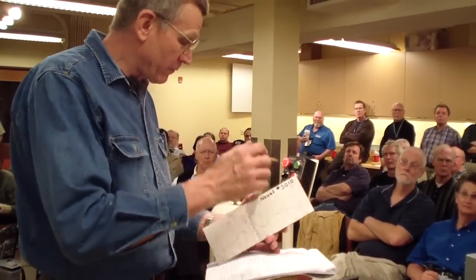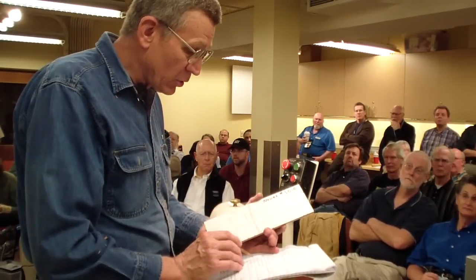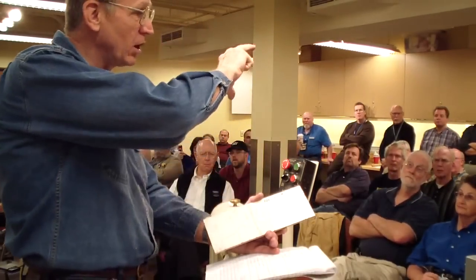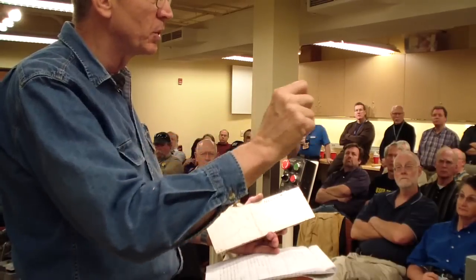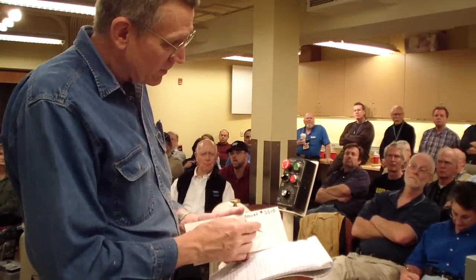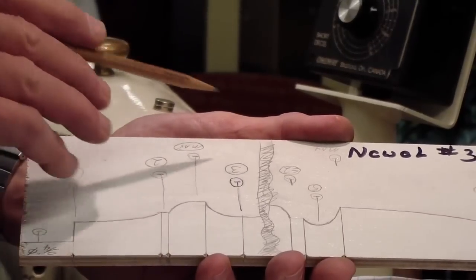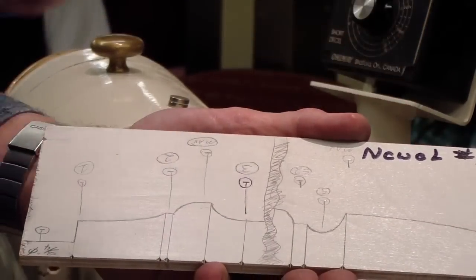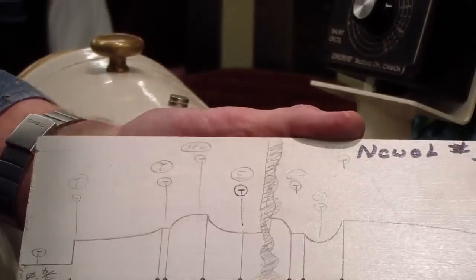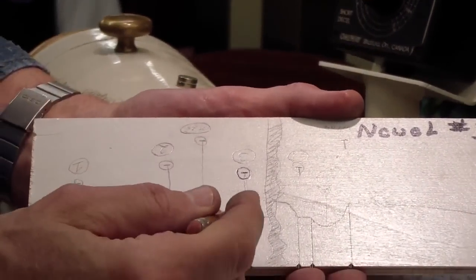And you lay out from your pommels, and then you have that break in your design someplace that is a simple part, such as a long taper or a cylinder, so that you can just look at your little picture and tell what you have to put there. Like this right here, you could put your break in there. Squash that up. A longer slope. Okay. And this right here, I've got a flare in there. This right here tells me where my break is. So that's where I have to add my wood, in here. This whole thing right here will come down and it'll taper all the way down like that into here.